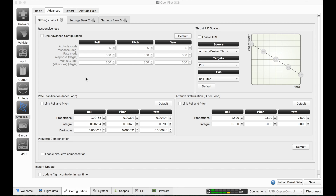One other thing I wanted to mention quickly, because I learned the hard way: if you have settings enabled that the board doesn't support, it's not going to arm. So any time you're changing settings, it's best to check if you can still arm your quad before you go out to the flying field. I had pirouette compensation enabled, saved to the board, went out to the flying field, and the thing wouldn't arm — so that was a wasted trip.